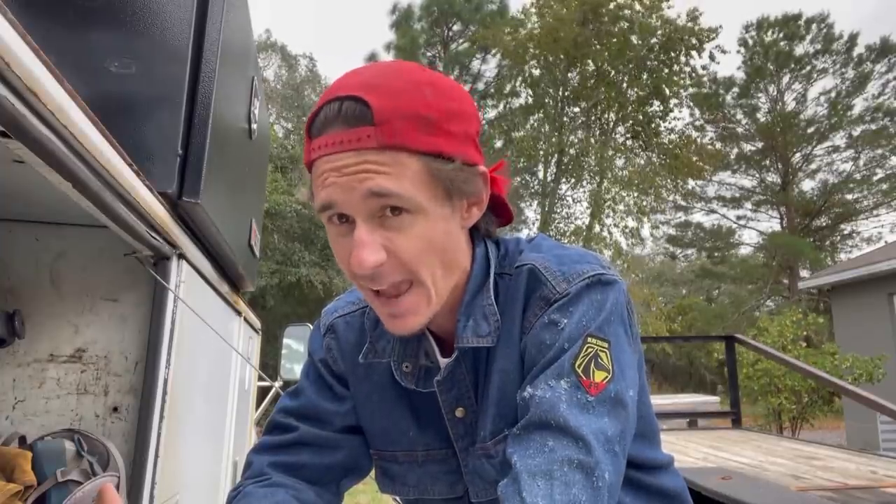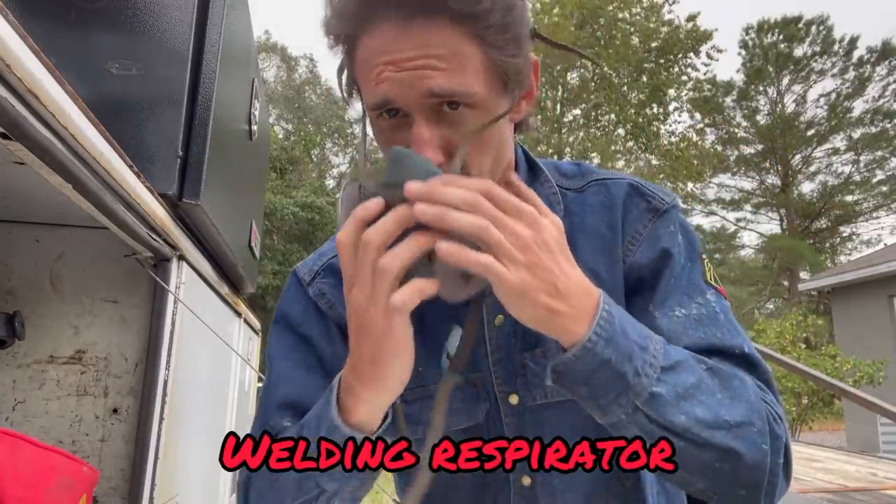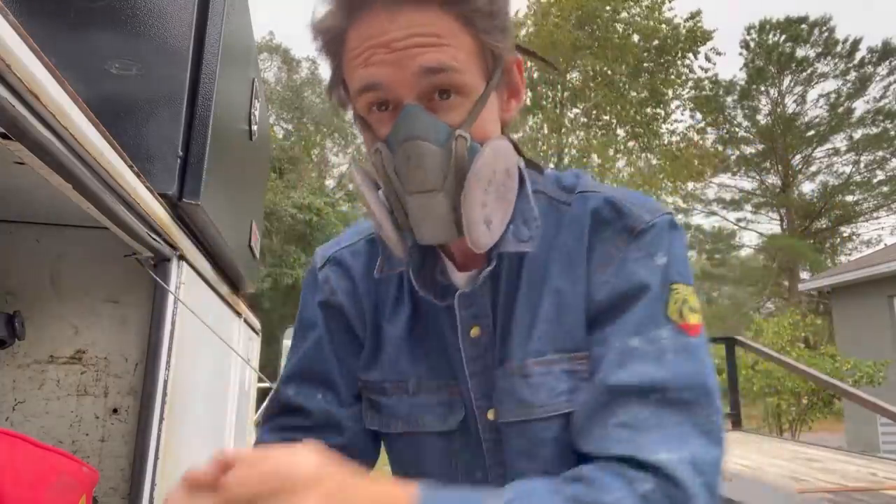You need to protect yourself. It's a pain in the ass to wear, especially in a humid climate like we are out here in Florida. But what it is is just one of these little respirators. I prefer the 3M. You guys have seen me wear this a lot. Quite frankly, nobody can hear a thing you say with it on, but this thing could very well save your life in the long run. I want you to go ahead and get yourself the 2297 because that filters everything out — you can see it says P100. Please go out and invest in yourself, because you are your greatest asset. You are your greatest tool, because without you, nothing can get welded.